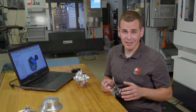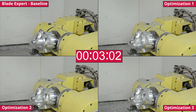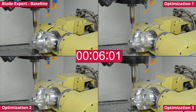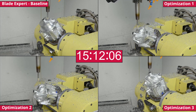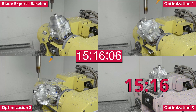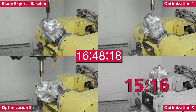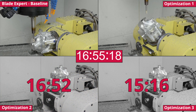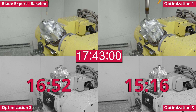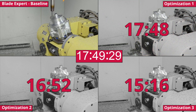I've got a camera set up in the machine. Let's get these three different optimizations posted out and load them up on our Okuma 5-axis and see the difference. There is a big difference in cycle time, bringing the cutting time from over 21 minutes per segment all the way down to 15 minutes for the most aggressive optimization. This is just one segment on one side of this small dual-sided impeller. On this one toolpath, that translates to over an hour of time for the entire part. If I was making eight of these, that's an entire eight-hour shift saved on just one toolpath. Imagine if this was a massive energy or aerospace component — the savings could be exponential.